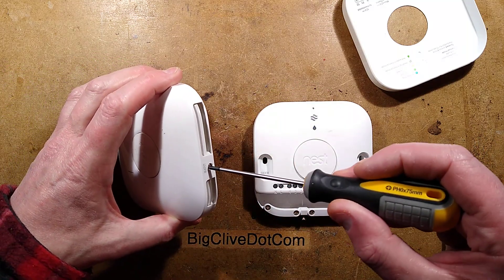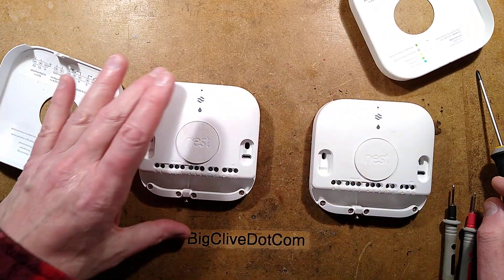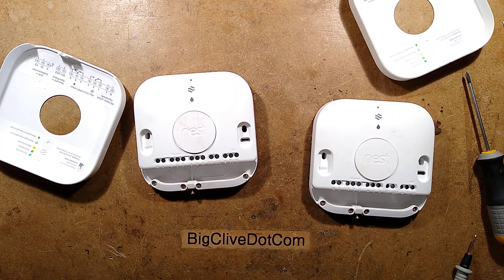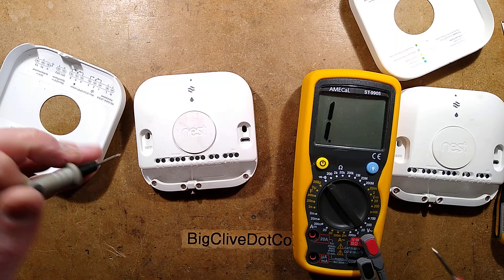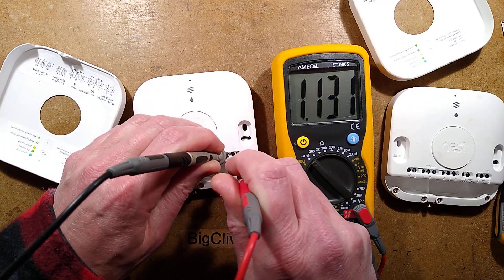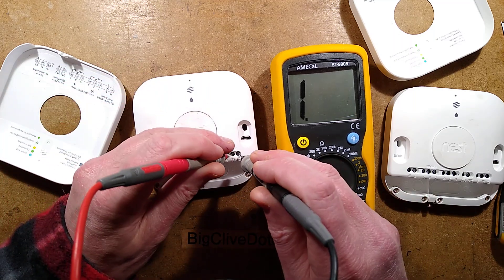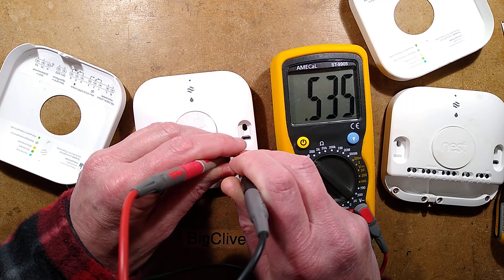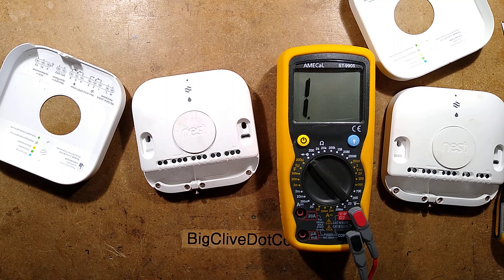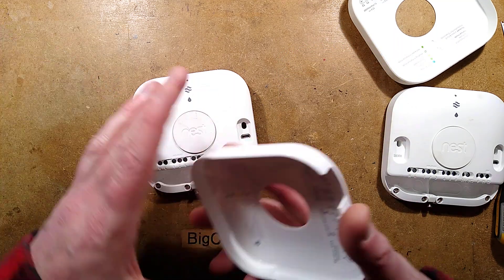Let's pop this one open. I'll show you what you should see if the 12 volt is not dead. If you set it to voltage while it was powered, you should get 12 volts. If it's not powered and the diode and everything was intact, you would get a rising voltage round this way, which indicates a capacitor is charging. And round the other way, you would get basically a diode voltage drop of about 0.535 — which is the diode I put in, probably less if it's the original Schottky diode. That's quite an interesting couple of tests you can do.